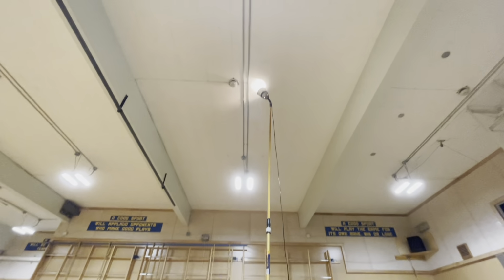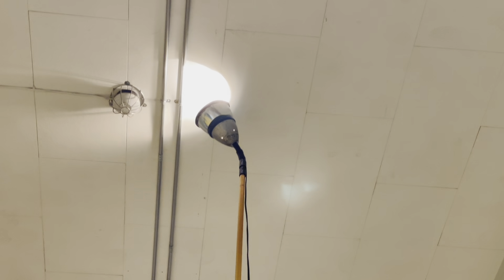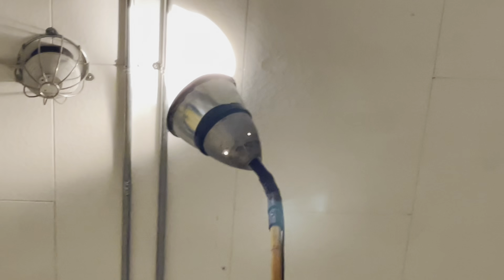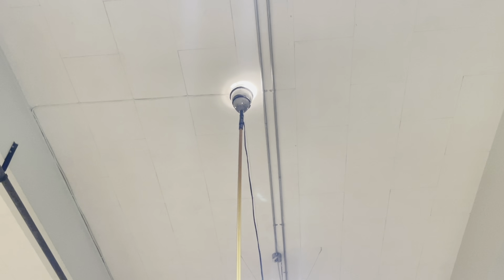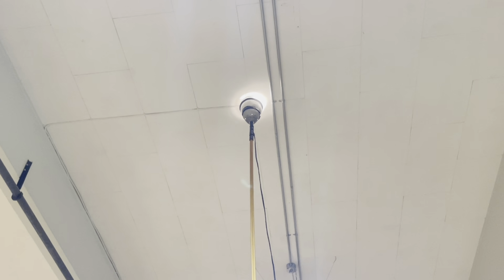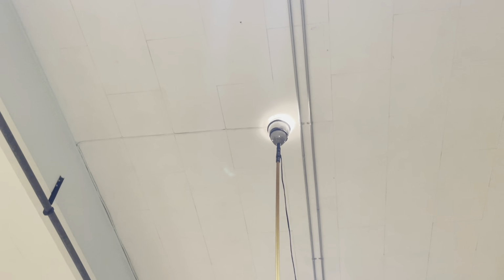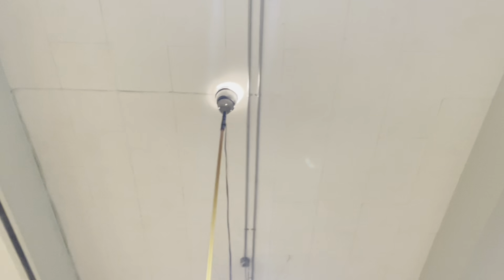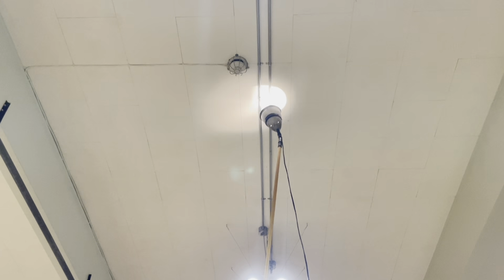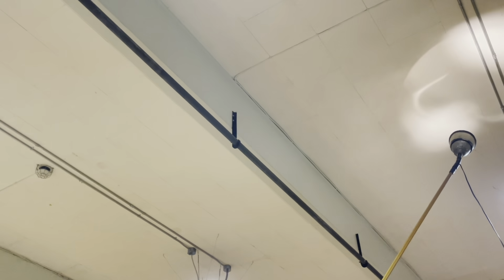Now we're on to doing the high up gym heat detectors. We've got the special heat detector tester. This is different than the short ones we use. It's got a wider head on it to go around the cages. And these are the ones you hope you don't pop them, because then you gotta get all the way up there to change them. So, one.